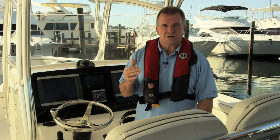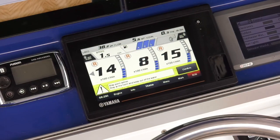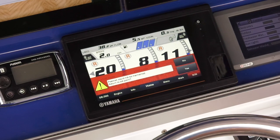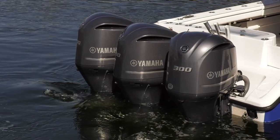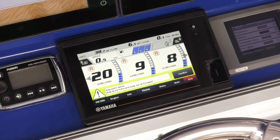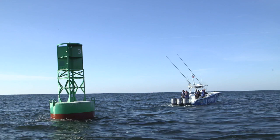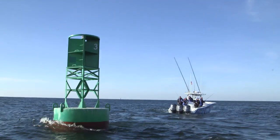As conditions and boat loading change, only you can determine the max RPM setting best for your current condition. Should your vessel move beyond the 75-foot circle, your CL7 will beep and display 'Unable to maintain position — would you like to return to the set point?' Selecting No or doing nothing allows your boat to continue on its path. Select Yes, however, and something very cool happens: the boat will actually begin to turn, determine the path of least resistance, and return to your marked set point. Once there, the CL7 display will beep again to let you know you've arrived, and it will attempt to better maintain the path of least resistance heading over your chosen spot.